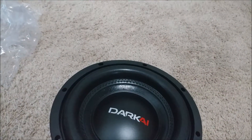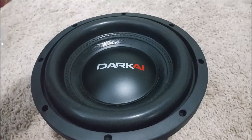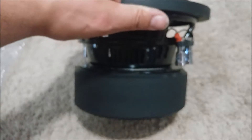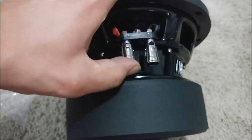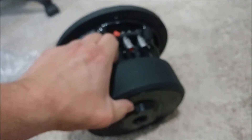It is a two-inch black ceramic coated copper voice coil. The NK-012 is a three-inch black ceramic coated copper coil. It's got eight-gauge push-style terminals, good quality, and nice pole venting. I can't get the boot off, but it feels like it might be a double stack — I'm not sure.